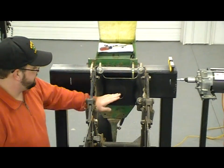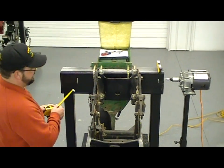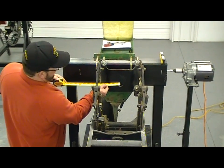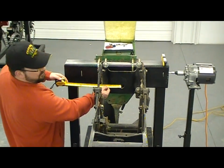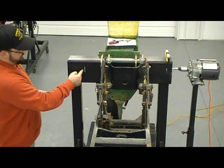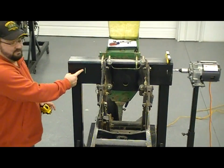As far as the straightness of the row unit itself, the way we're going to check that is we're going to measure from the center of the parallel arms. We're going to go off this hole here in the middle and measure out a known distance to the outside and mark our toolbar. In this case, we've measured out from the center on each side 12 inches, or one foot, and put a chalk mark on the toolbar itself.